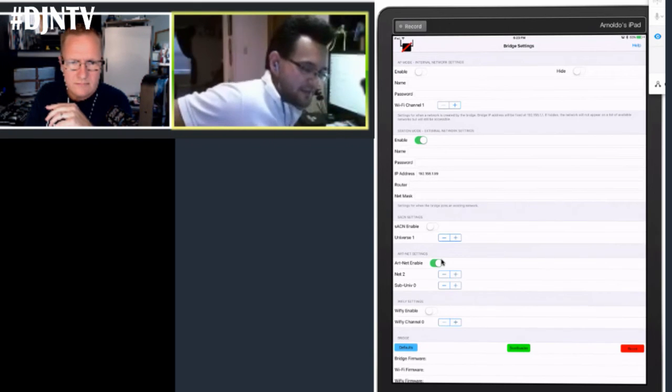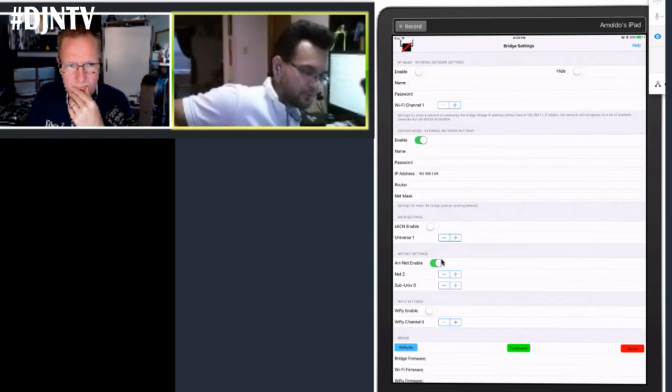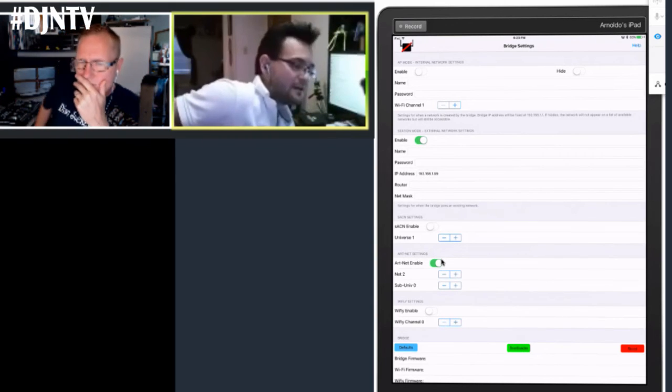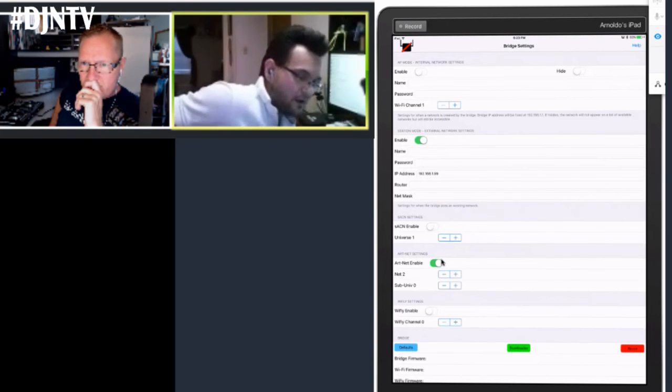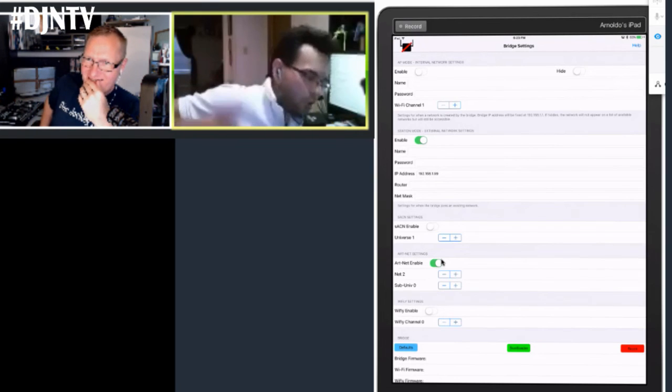Above that, it says sACN. That means streaming ACN. This is like ArtNet, just a heck of a lot easier. It's pretty much plug and play. It sees the network. Great. You log in. You're done. It has two-way communication. That's the best way that I can really say it. It's ArtNet the way ArtNet should have been. But you're talking, that's for like grandMA, whole hog.